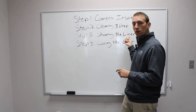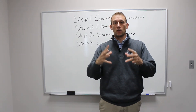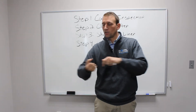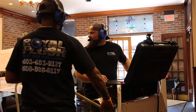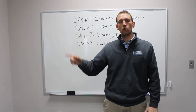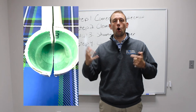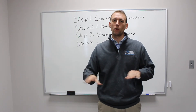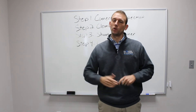We've shot our liner down the pipe and it has a liquid epoxy resin in it. We've blown it up to the shape of the pipe. Now we're going to insert a UV ultraviolet light head — basically a really fancy light bulb. We push it to the end of the pipe, set it to a computer program based on the dimension and length of that pipe, and it's going to slowly pull back at the right speed. Those lights then have an instant chemical reaction with the epoxy resin and turn it to a rock — that's what gives us our final hardened epoxy liner, your new pipe inside your old pipe. This is without a doubt the coolest technology we have.